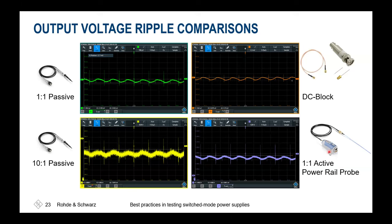And you might see these high frequency components that could easily propagate through a rail to your system on chip and then cause there a watchdog saying, oh, I'm out of spec here and I'd like to reboot. And this might be caused by this unattenuated propagation inside the system.